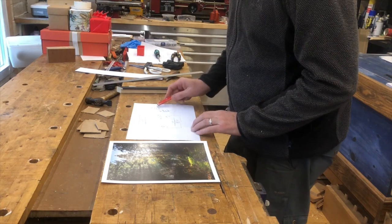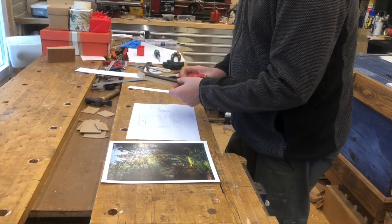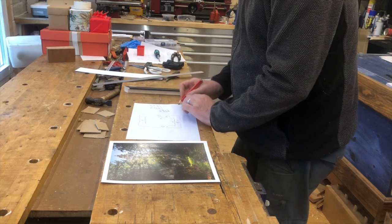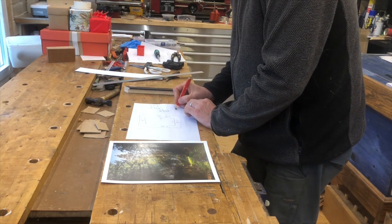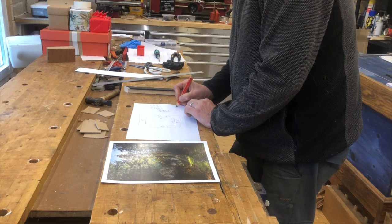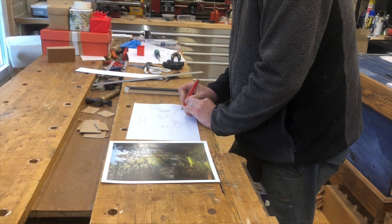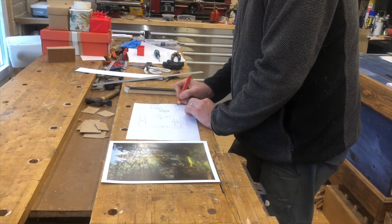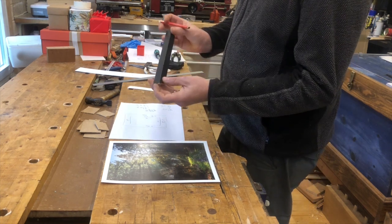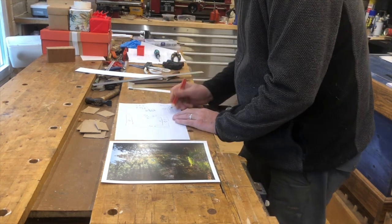It needs to be an extra 15 millimeters, because these are actually 20 wide with a 5 inset. So I need to add another 15 for each side. So that's another 30 to each, so it's 250 plus 30, and 305 plus 30. So these are going to be 280 and 335. So that's going to be the size, the outside measurement of these sticks. So that's the sticks.